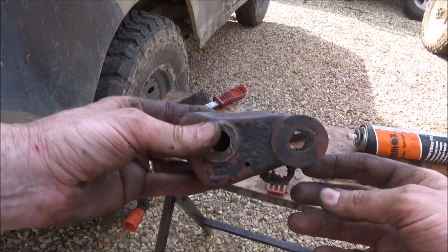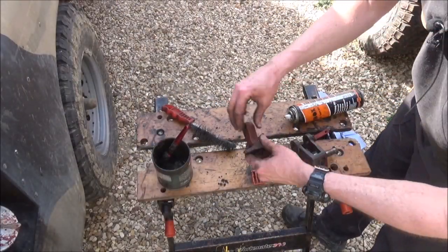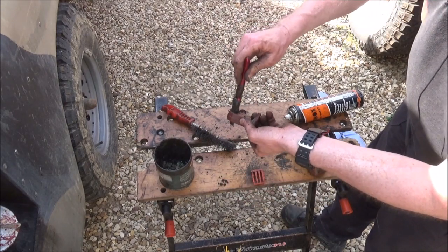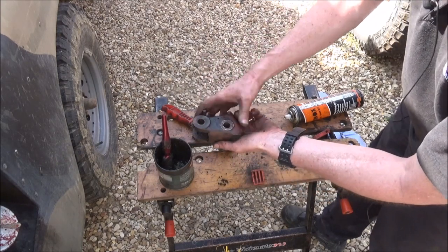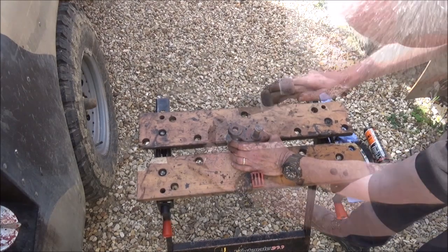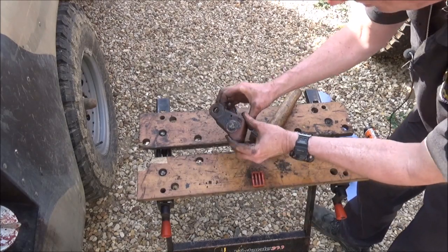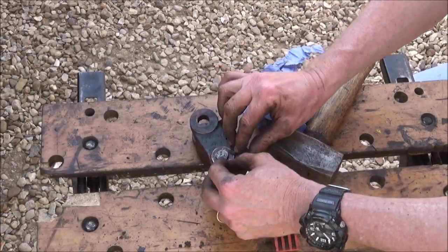Looking inside this there's a spring mechanism to hold the plate in place. The first thing we're going to do is get a bit of grease on the inside of this — this is the locking mechanism for it. Then push that into where it's going to be. Hopefully that still moves freely — yes, which is good. That's exactly what we wanted to do. The E-clip just slips on.